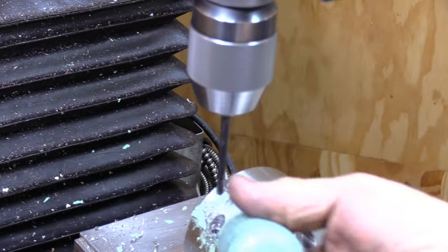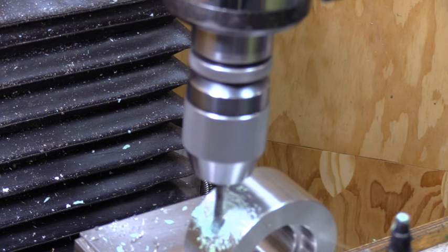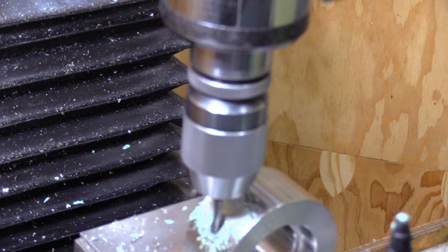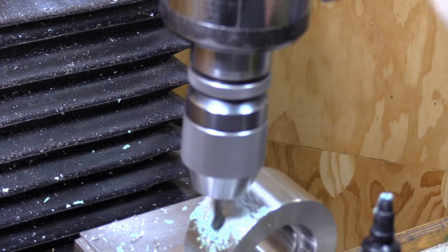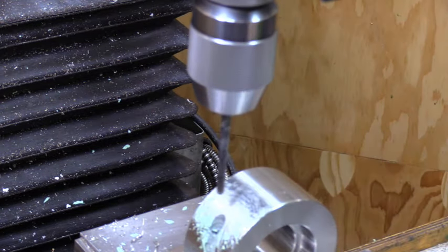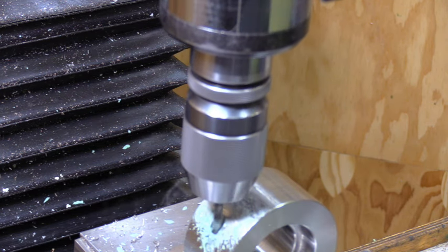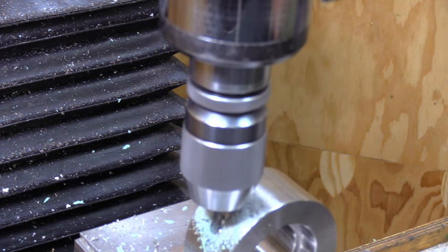Drill. I'm gonna drill all the way through. Because this is on a tractor in dirt, you put a blind hole in, you know, next thing you know, it's gonna end up getting plugged up with dirt. If I can go all the way through, it'd be great.